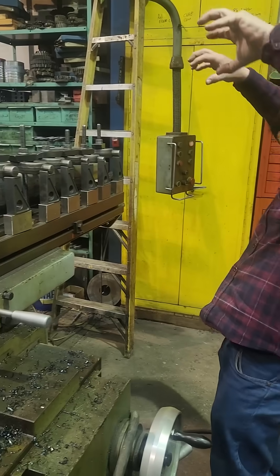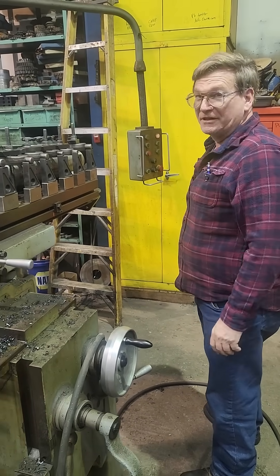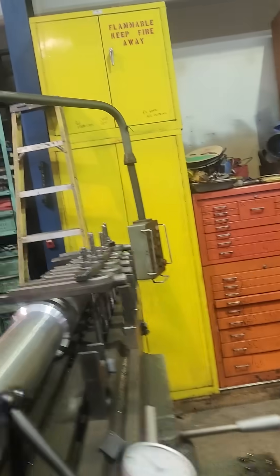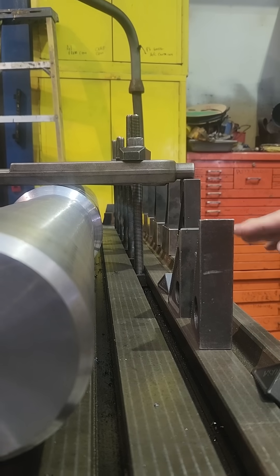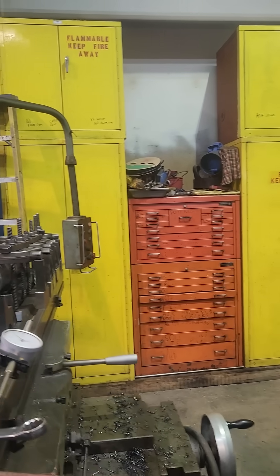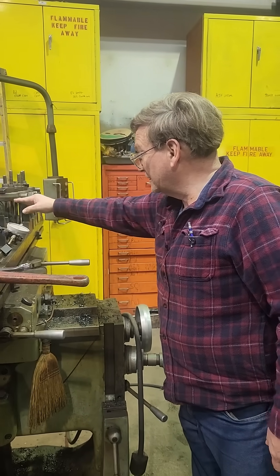Six clamps! We're going to hold it down. Six clamps really don't hold that much, but we needed six. If you look at it over here, you'll notice that my point back here is way, way back from where I'm clamping on the shaft. So my leverage is against me. All six of those is about the same as if you had two with a good advantage. So you've always got to look at what you're doing.